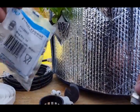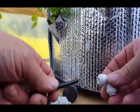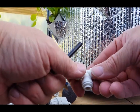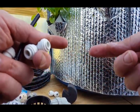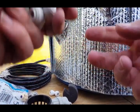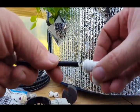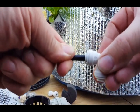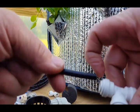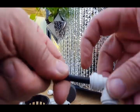I've been using these John Guest fittings. Anyone not into plumbing probably wouldn't know them — I didn't. They almost work like one of those Chinese finger puzzles when you're a kid. You put your fingers in and the more you pull away, you can't get it off. You have to push in to slide it out. You push it in and it will not come out when you're pulling away, but if you hold the edge of the fitting it slides right out. These have been excellent — I love them.